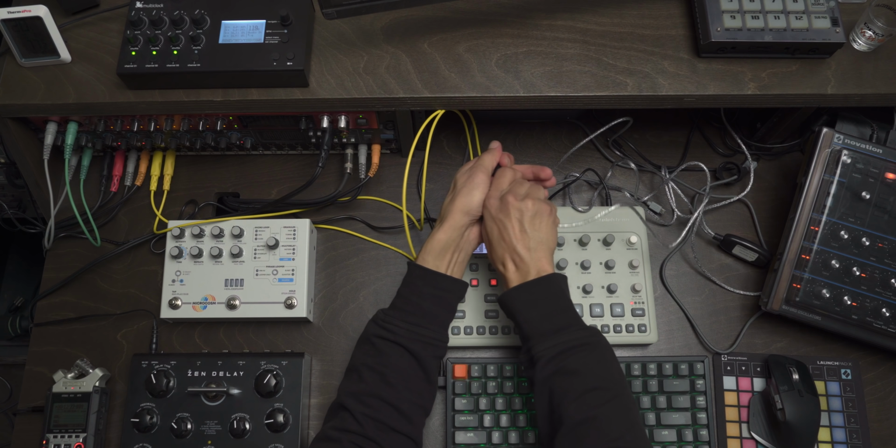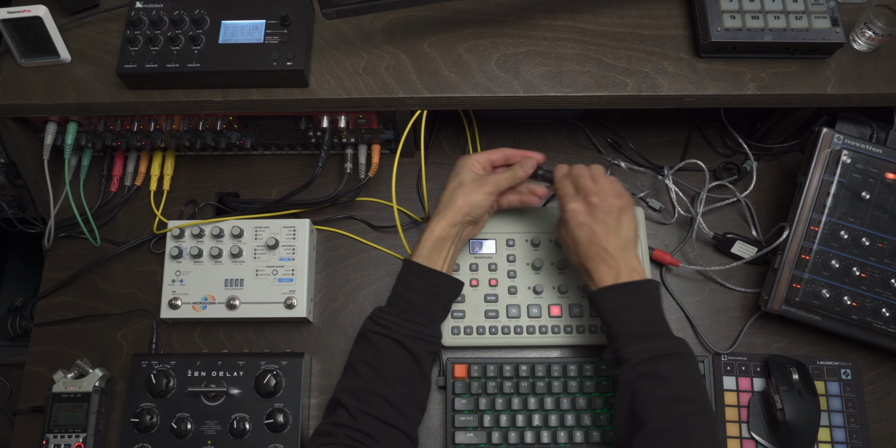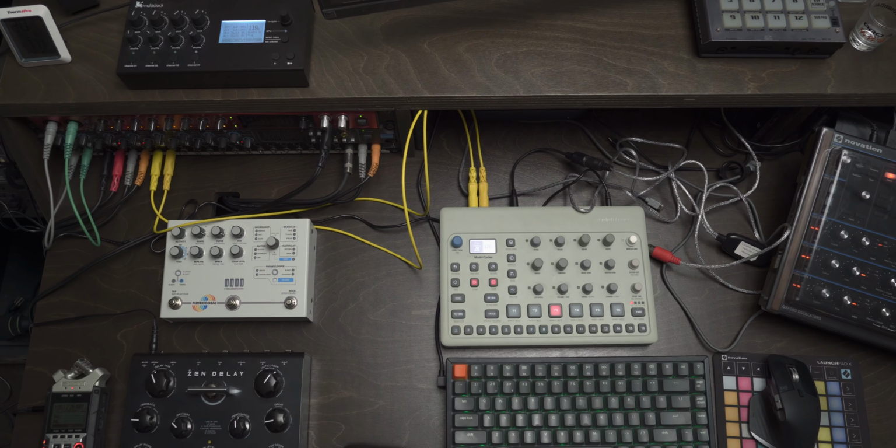So that was correct. The only other thing I can think of is that this adapter is a different standard. This is the Novation one. I know that one's made to standard, but the old Circuit ones, the colored ones, those aren't to standard. I have one of those, one second. All right, so these cables, like these kind of yellow ones for the Mono Station, are not to standard. And basically what that means is inside a 5-pin MIDI DIN, you're only really using 3 cables, which is why they can use these, which are TRS. There's 3 points of connection.